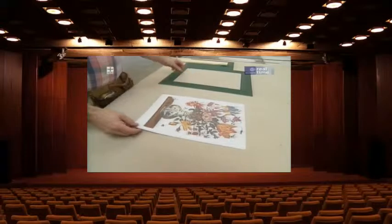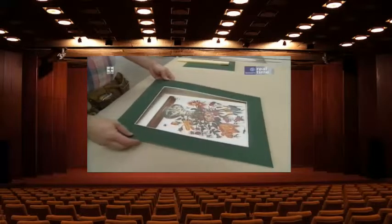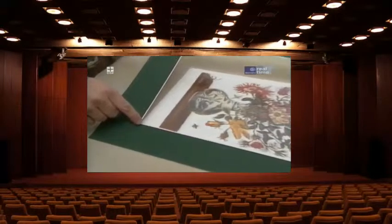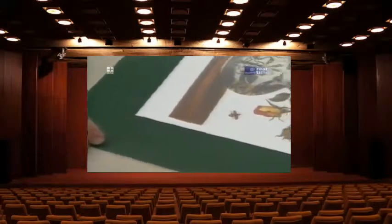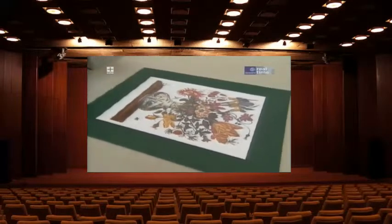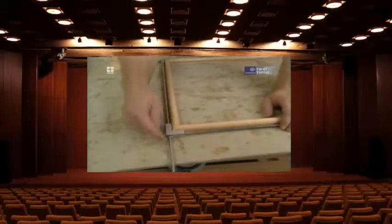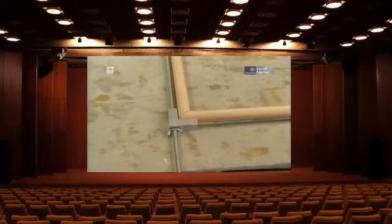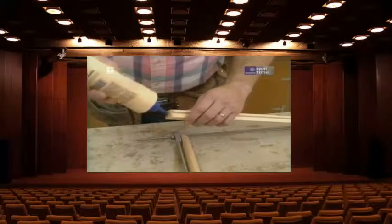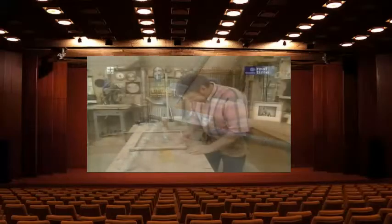The subject for this frame is a botanical print, paired with a forest-green linen-type mat. The beveled window cut reveals the white underneath, which really helps offset the print. Another reason for using mat board is that it separates the artwork from the glass. This frame is glued up using a slightly different clamping system — threaded rods and corner blocks, which works really well. Any glue that squeezed out gets wiped off and the frame is set aside to dry.